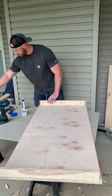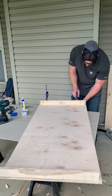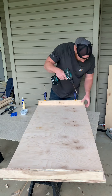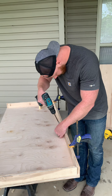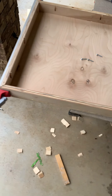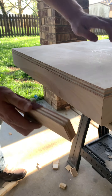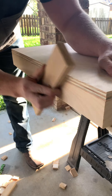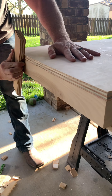Always try to get it right where you want it and then throw in your pocket hole screws. If you don't already have a bunch of clamps, Harbor Freight really does have good deals for the price and quality. Once you get all those glued and screwed down, use those straight-edge clamps and clamp the corners until they dry. Then put some sandpaper on the block and get all the edges nice and flush — start with 60, then move to 120, and then eventually to 220 grit.